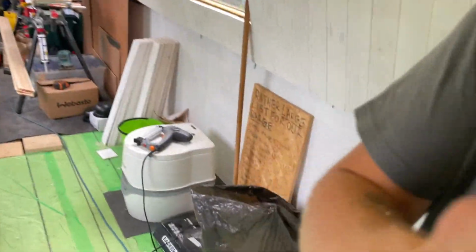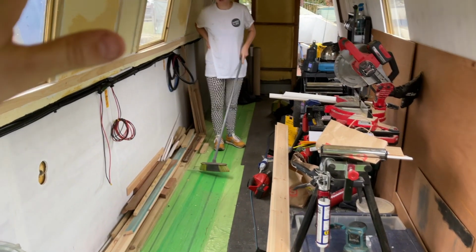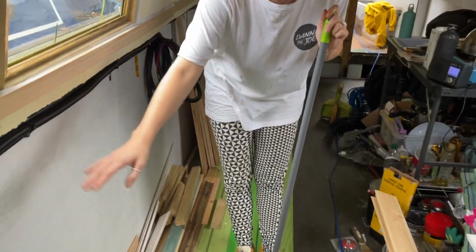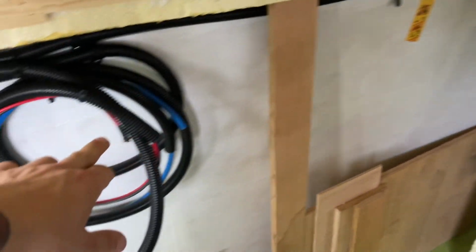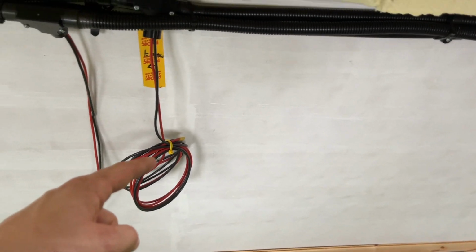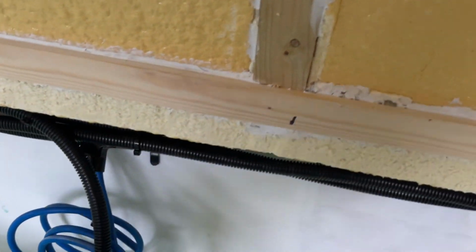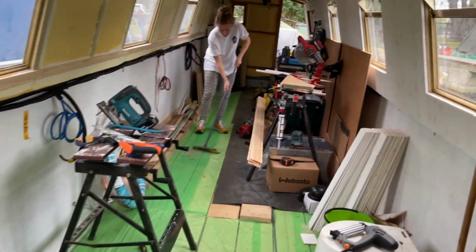Thank you. Lovely. So just before we bury all the cables and conduit, I thought I'd give you a rough layout of what's going where. Is that right? Yeah, and what cables are in these? So starting at this end, we've got freshwater tank, USB plug, 240 volt socket, bathroom, fridge, grey water pump, 12 volt sockets in the island unit, breakfast bar, 240 plug there. All comes up here where our cabinet's going to be. That's all. Sweet. Right, back to cladding.